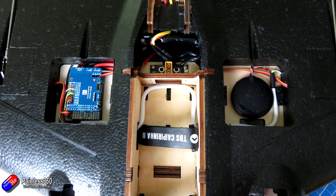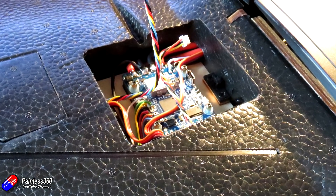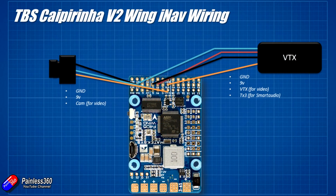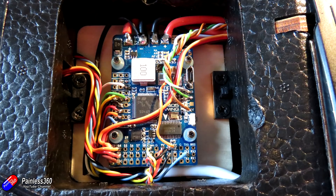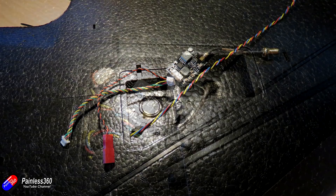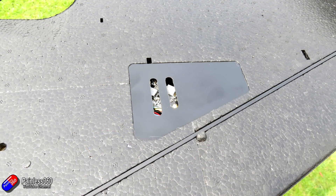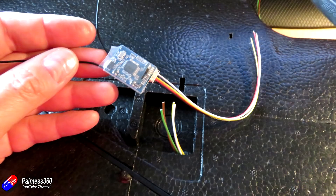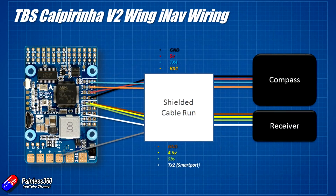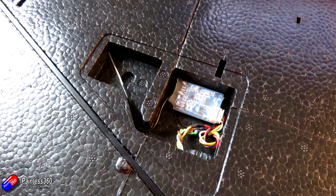Next I installed the VTX and camera. The camera just pushes into the nose of the wing and the cable feeds through into the bay. I also ran another four cables out into the video transmitter bay. The blue cable going to TX3 is the transmit pin for UART3, which will be used for smart audio. The VTX cables had to be cut and remade at both ends, but once done it nestled beautifully in place — I cut a couple of holes in the cover for ventilation. On the other side I wired the radio receiver, carefully double-checking my diagrams, using heat shrink to keep everything safe, and leaving a little extra wire in case I need to make changes later.